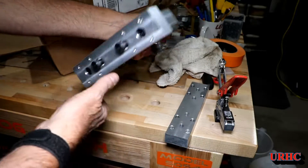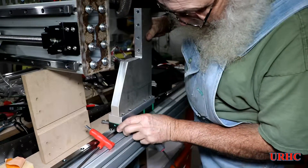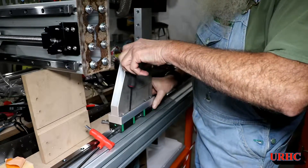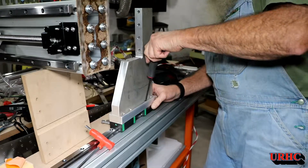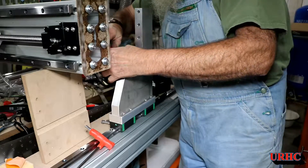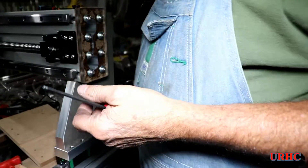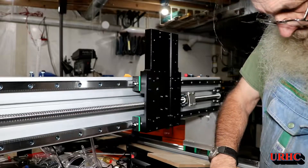I also machined the base blocks for the sides - you can see how it all goes together. Now I'm doing a test fit of these parts. There's still more machining to be done and a couple more features to add, but right now I just want to make sure I've got the elevations correct for my clearances, the spindle height, and that all my mounting holes line up with the extrusion. I'm really amazed by these low-cost slides - how smooth, nice, and tight they are. Once they replaced that one slide that was too wide, all of them are great.